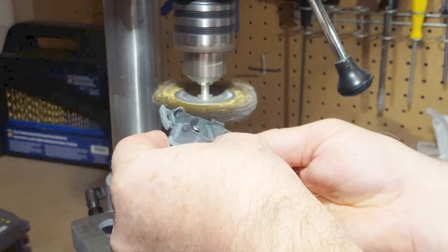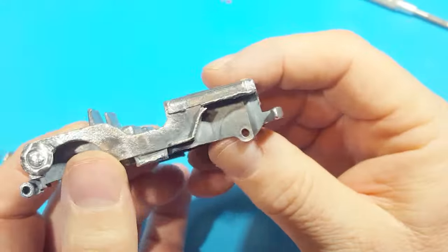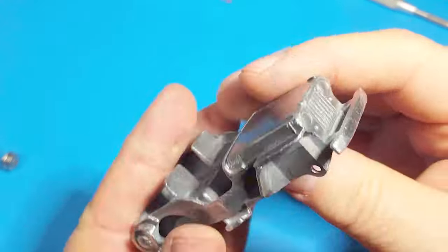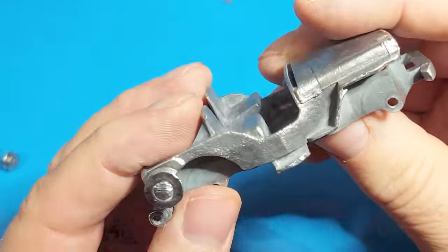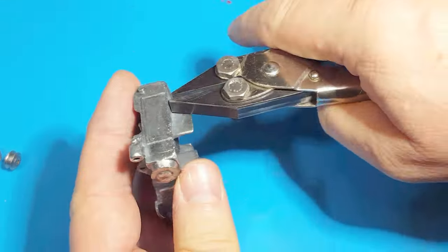So it's out of the paint stripper, out of the caustic soda, and I buff it up on the wheel on my bench drill press. That makes fast work of it. I can't get into some of the corners, but anyway you can see the damage on this. It's all dented up and it's going to need a lot of filing and sanding and filling.